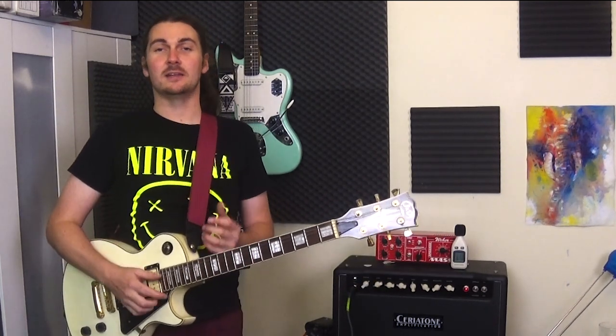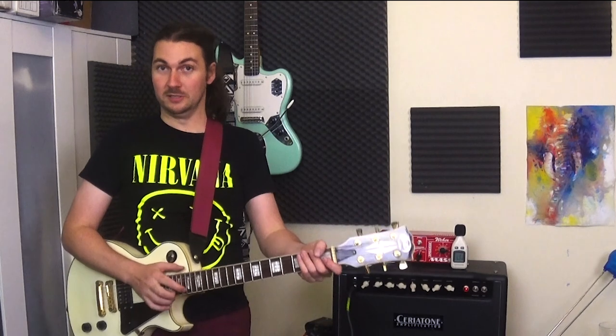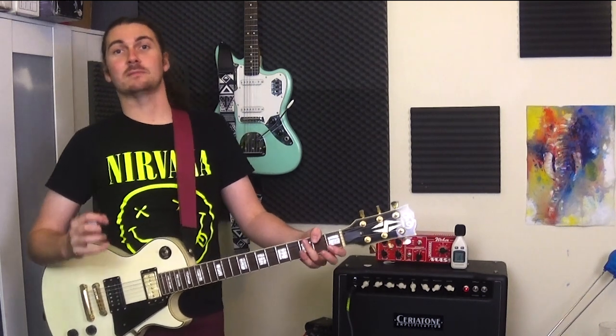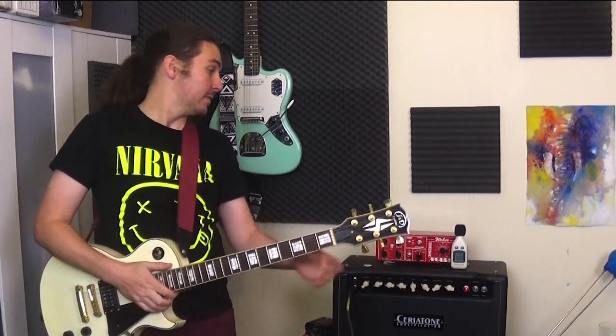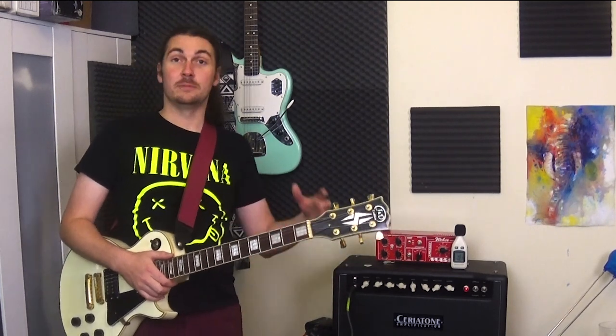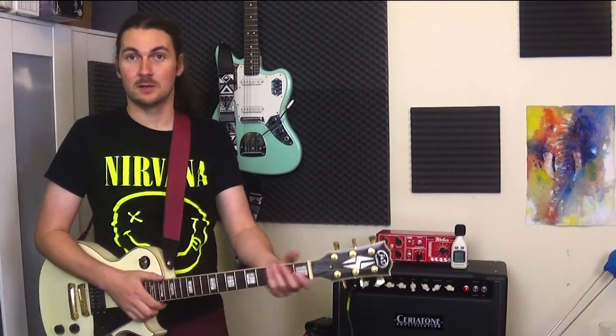What is an attenuator? Well, basically, when it comes to tube amps, you generally want to get a fair bit of volume out of your amp to get it to the best tone. This doesn't always suit your situation. If you're in an apartment or a small stage, getting your amp to that sweet spot may not be plausible — it might be too loud. That's where attenuators come in. Basically, they're a device that sits between your amp head and your speaker box, or if you're in a combo, between the actual amp part and the speaker inside, and it absorbs the energy from the output transformer, allowing you to get lower volumes.